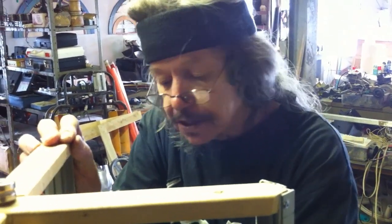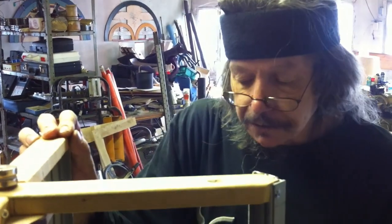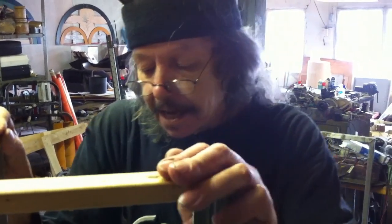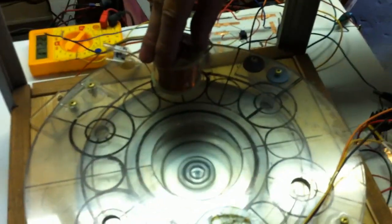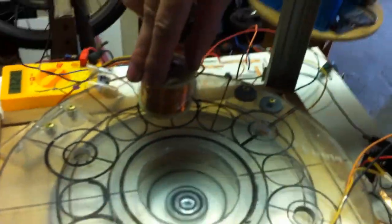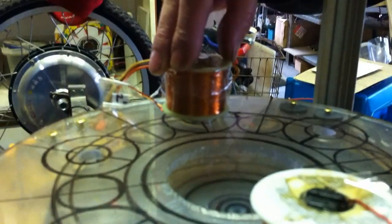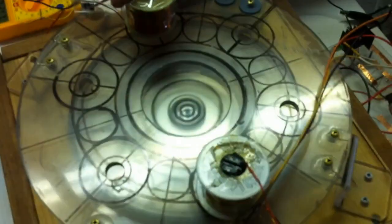The speed on this one is about 500 to 800 RPM, which will give roughly 60 volts in three-phase. But if I can make a bigger one — like the small one that went up to 10,000 — and get it to 2,000 RPM, it'll be 140 to 160 volts. I could put in a voltage divider to give twice the amperage, making it okay for 60-volt wheel systems. The coils are just laid here — not tied down — and they're both at 17 volts running at approximately 800 RPM.